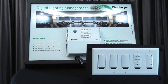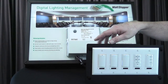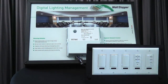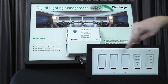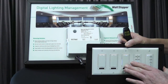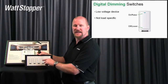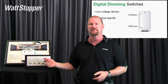The way this switch operates: tap the top for on, tap the bottom for off. Press and hold the top to ramp up; press and hold the bottom to ramp down. It's pretty intuitive and user friendly. We've also got seven LEDs on the side, and each LED has basically two levels of brightness. As you ramp down, those LEDs show an intermediate brightness level, giving you 14 steps of indication. So you can replicate 50% and 75% light levels very accurately.